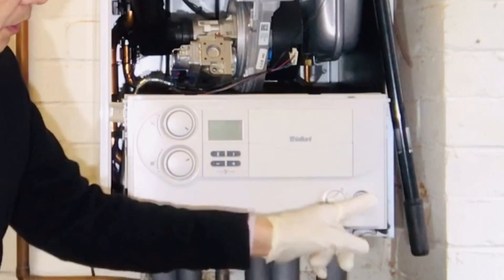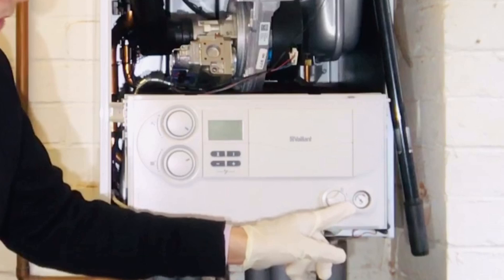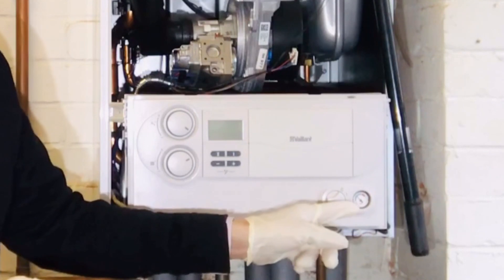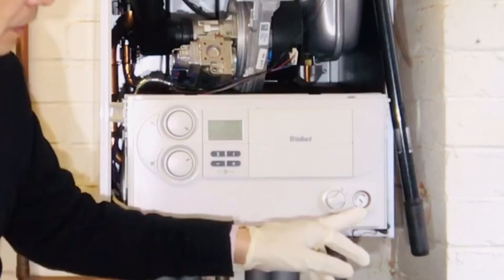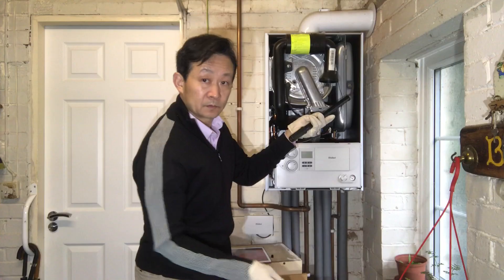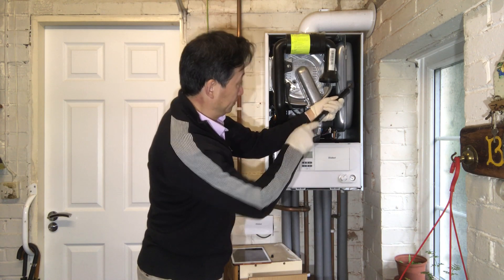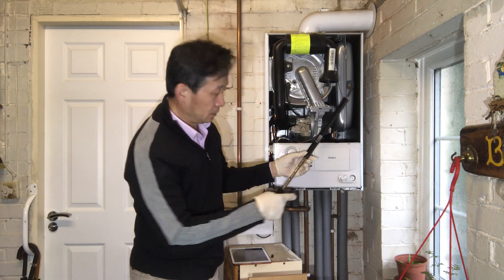However, do not let the meter go into the red range, because that is too high for the boiler. Also do not let the meter get too close to the red range, because right now my central heating is off. When the central heating is on, water temperature goes up and the pressure will rise further. The pressure should ideally be in the top two-thirds of the green range. I will top up a little bit more air. The pressure starts to drop slightly, so I will pump in a little more air — okay, about two-thirds pressure.